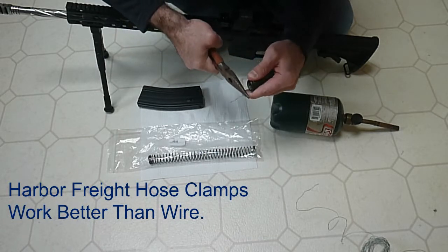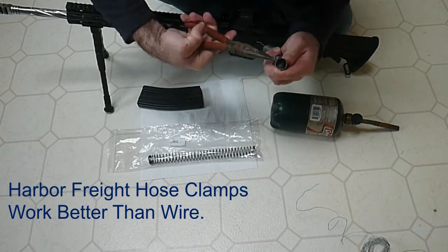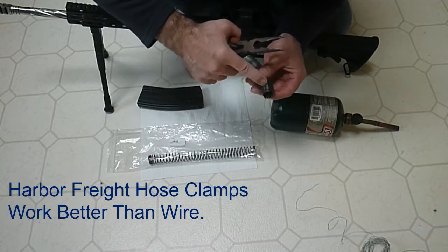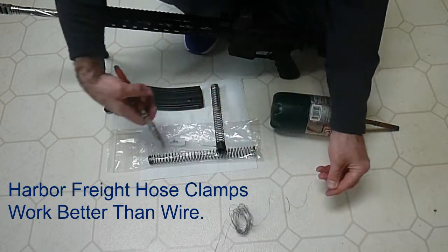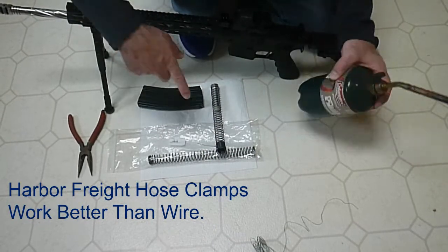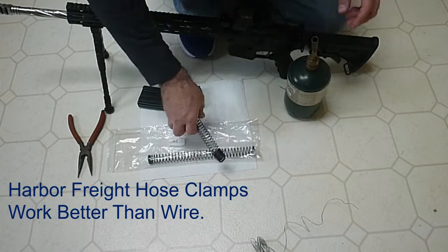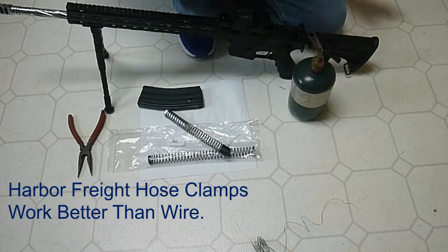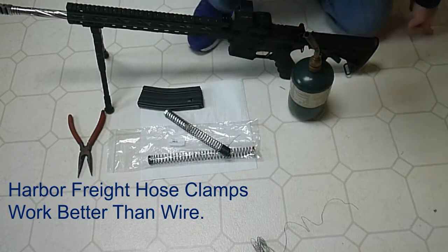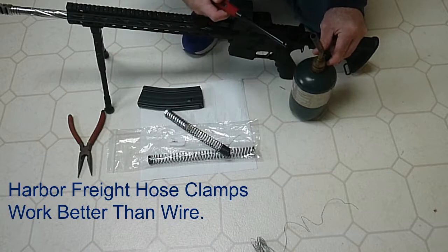Now you don't have to get this too hot or anything like that. I'm doing a horrible job on this wire, but I think you get the point. And what I did was I ran like three or four all the way around this thing. I don't want to put you through watching me wire up all these coils, but once you get the coils wired up like that, and you've got a couple of knots in the wire, and you're pretty sure it's not going to come undone, you go ahead and take a propane torch, and all you really need to do is get those coils just barely red, and that's how you're going to know that enough temper is out of it to work correctly.